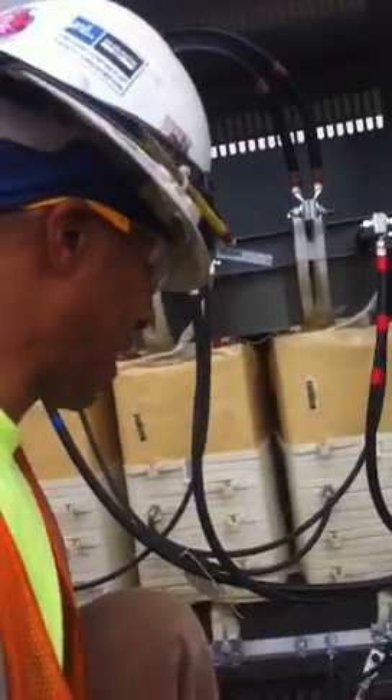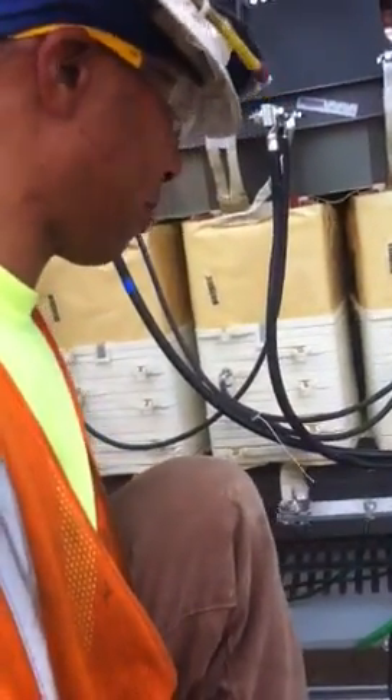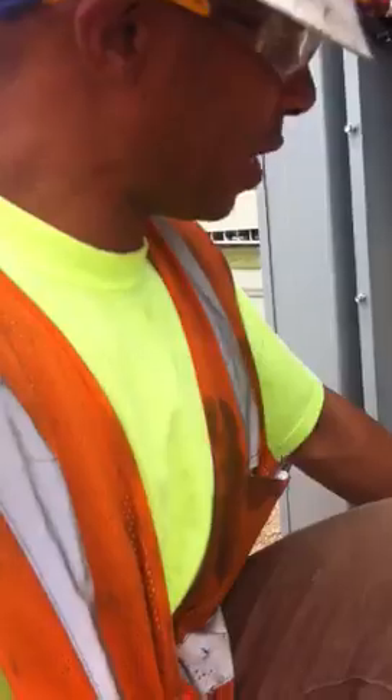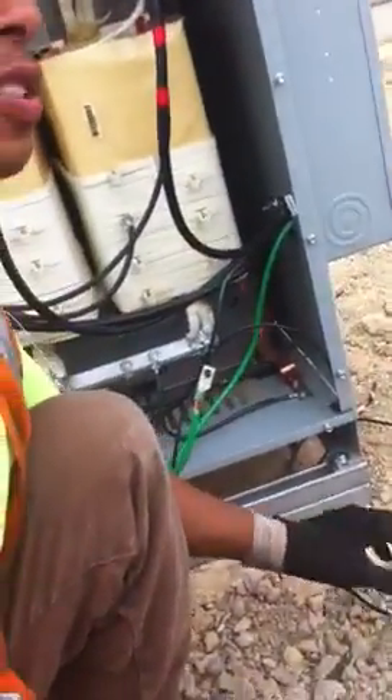You put a lug, or any type of lug that you wish, depending on how you want to ground the X0. And here's the X0 for this transformer. There's the neutral wire — the neutral wire goes from X0 to the panel. And what it does, it carries the unbalanced load back to X0, and X0 carries it back to the ground rod, to the earth.